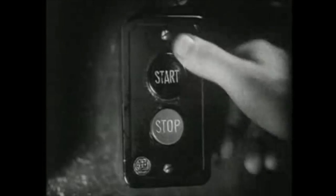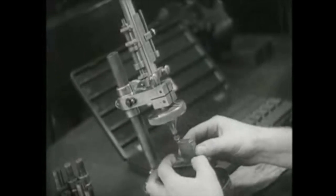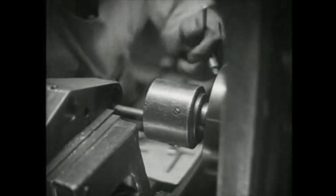The question here is, how do my crooks differ from the traditionally made crook? The traditional crook is made from a piece of sheet brass cut into a very long triangle shape, then bent over, and the seam is then brazed. The brazing material, of course, is softer than the brass itself. It has to be. That's the way it is. And that process, although quite difficult, does not produce a really satisfactory end result, because the brazing material, being softer than the original brass, is liable to be weaker and over a period of time may crack up. This is how crooks have been made for literally hundreds of years.